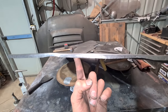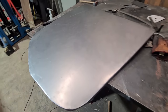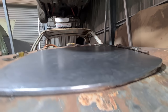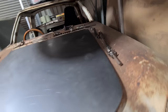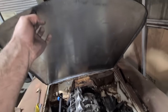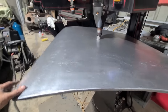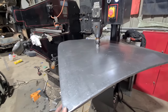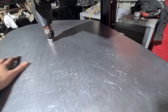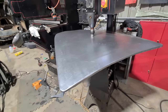Used the hammer and dolly to turn the lip to 90 degrees and now you can see how flat the center is — not the right shape at all. I'm going to chuck that in the wheel and put some shape in the center. My experience with shaping is extremely beginner level so I'll probably over-shape it, but that's how you learn.